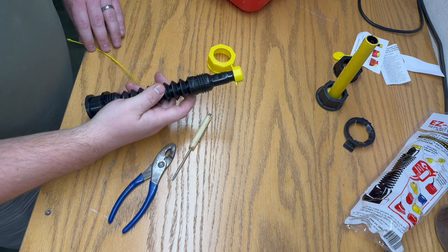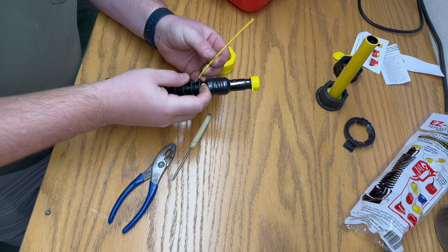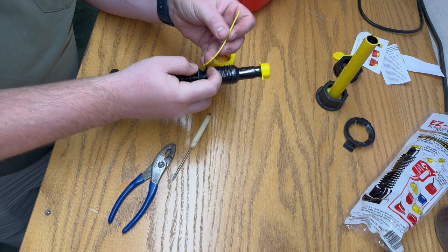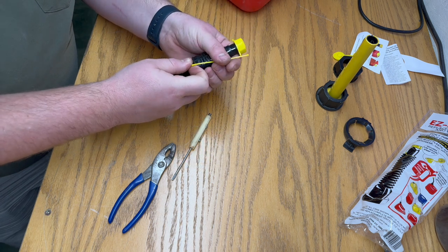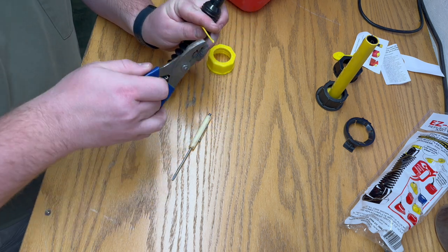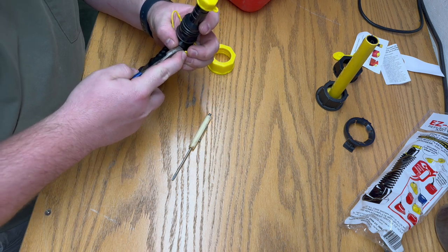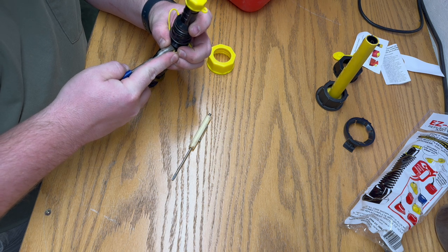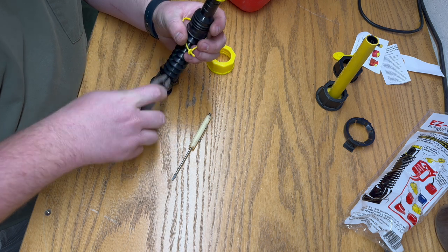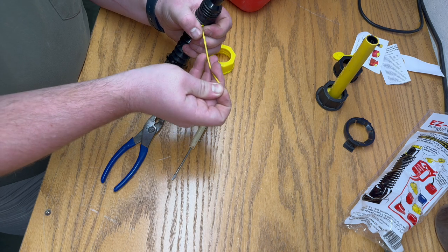You're going to want to put your little cap stay on. What you're going to want to do is wrap this around the corrugated section. It's got two little nubs here — you can see that — to keep it from popping off, and then another little nub there to keep the cap on. I found it's a little easier if you grab it with a pair of pliers. Wrap that through this guy without breaking it, wrap that through there, then tighten it up around your nozzle.